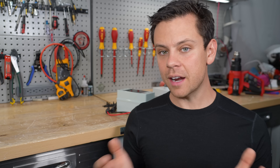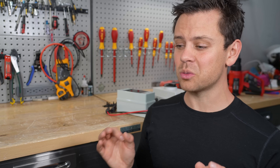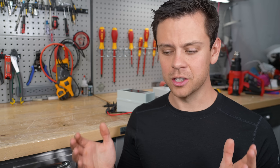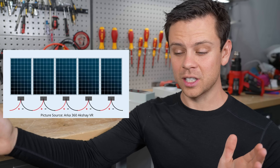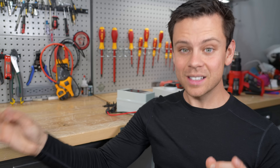But if you know what you're doing, you'll never get hurt. The most dangerous part of a solar system is without a doubt, every single time, going to be the solar panels. When you put them into a series string and create a large voltage upwards of 500 volts DC, that type of electricity can kill you instantly.